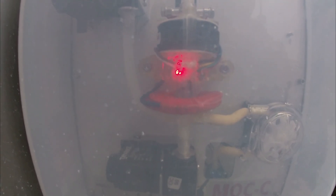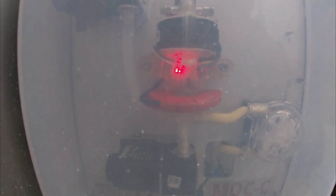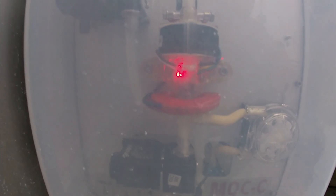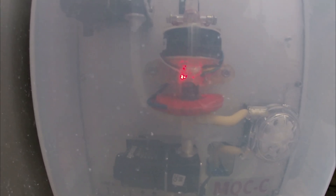Then they have an electromagnet — this little magnet that they turn on and it pulls up the magnet, then the magnet sinks down. It pulls the magnet up and measures how long it takes to sink down. Depending on how thick the milk sample became, it takes longer or quicker to sink down, and based off of that it knows the somatic cell count.